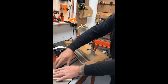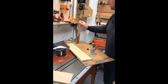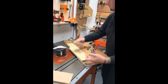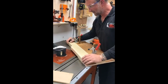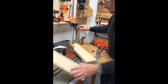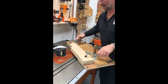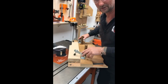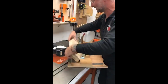One thing I'll point out, actually, if you do have an awful lot to do with a cutter like this, it's got a really big height of cut here. This cutter blade is 50 mil. This material is 16 mil. So if you've made the jig correctly, this one isn't jigged up to do two. If that's on there like that, and your clamps are adjusted, there's nothing stopping you putting two through, halving the time that it takes to do this particular job. Nothing wrong with doubling up, providing everything is set correctly, you've got the power on the machine. That will save you even more time.